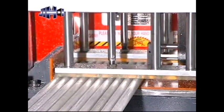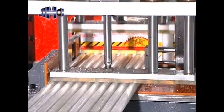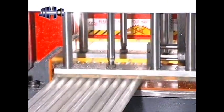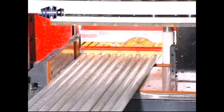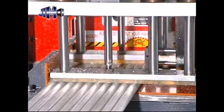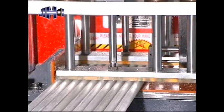The workpiece clamping system consists of two vertical clamps and a horizontal clamp, actuated by independent air cylinders for clamping the workpiece securely. Irregularly shaped workpieces can also be clamped. Clamping pressure is adjustable to avoid workpiece deformation due to over-pressure.